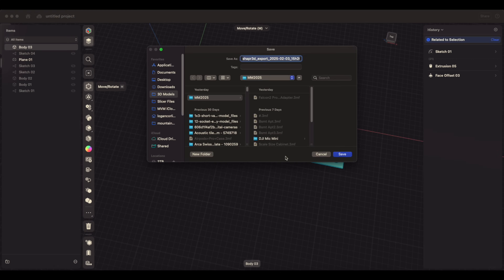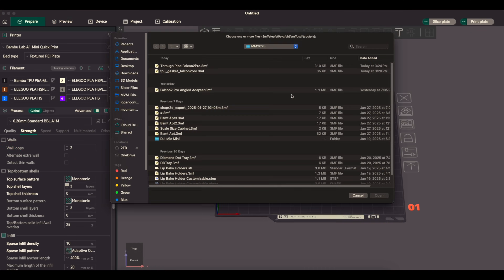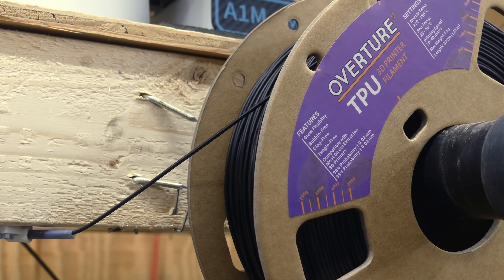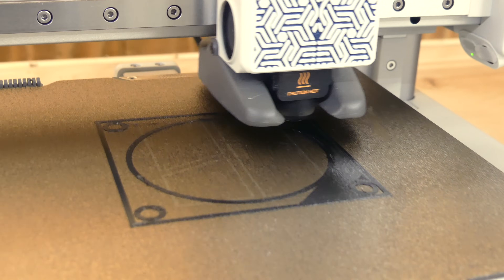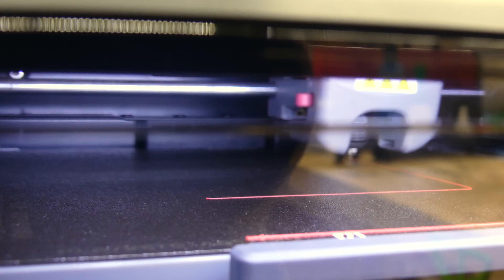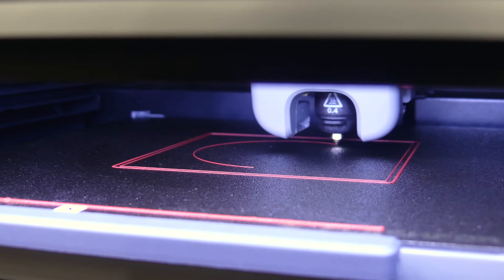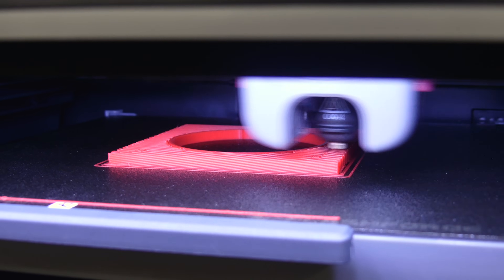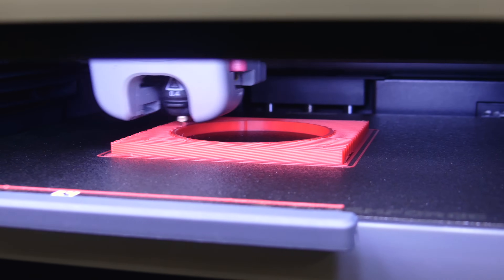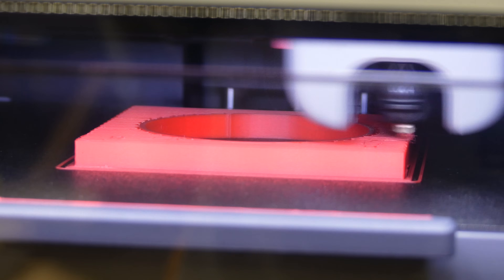Throughout this screen capture, I'm copying and pasting the sketch a couple of times — using it for the TPU gasket as well as the actual part that's going to go through the wall. That wall-through piece I'm going to print out of PETG High Flow on the Adventurer 5M Pro. You can also see the TPU gasket being printed right now on the A1 Mini 2. The piece from the Adventurer 5M will go through the wall, and a mating piece on the other side in our third bay will friction-fit into the pipe and get screwed in from the other side, sealing off any critters.